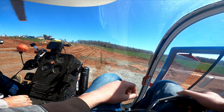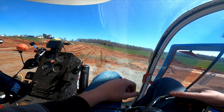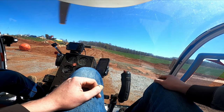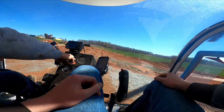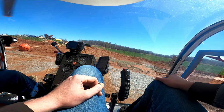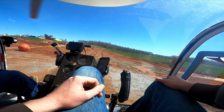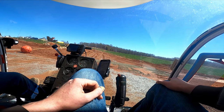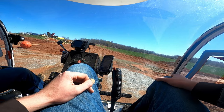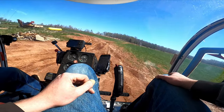We're waiting for temperatures to come up and then slowly increasing throttle on the collective. Once we get the throttle up we'll start to increase pitch, and you'll see the stick moving around. He's increasing throttle and giving it a little more pitch on the blades until it just starts to fly. He'll keep the helicopter from drifting because we've got a bit of a crosswind. This helicopter doesn't have the power of a turbine like a Black Hawk — it can't fly straight up. You have to fly through what's called a transition zone at about 18 miles an hour.